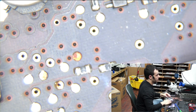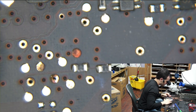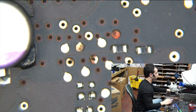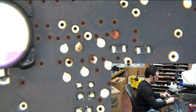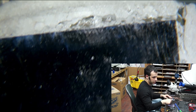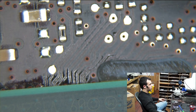Yeah, in this area, you can't see anything because I have the light turned all the way up there. The camera doesn't like light as much as I do. Yeah, you could see that there's a lot of red probe points over here. And this general vicinity looked nasty. Now, if this is the CPU right down here, right? So I'm going to show you on the schematic why it is I thought that CPU vcore was the fault.